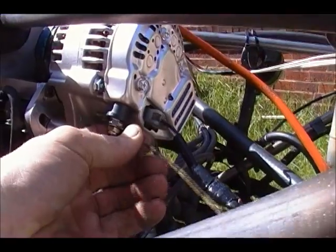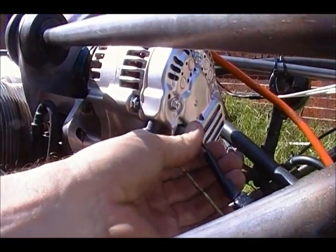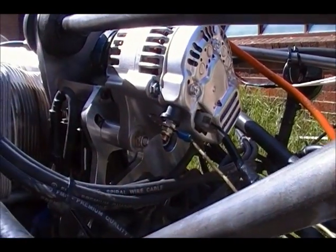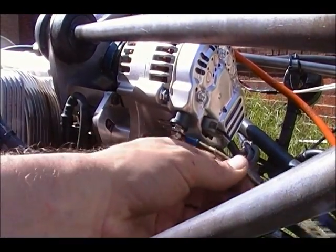That's a very neat installation. That's your main battery wire there, and then your regulator and regulator warning light there — just like a car. There's no need for a field switch. You just switch it on and off with the masters, no problem.